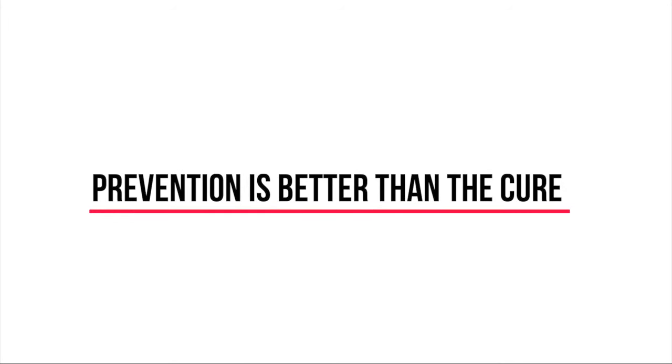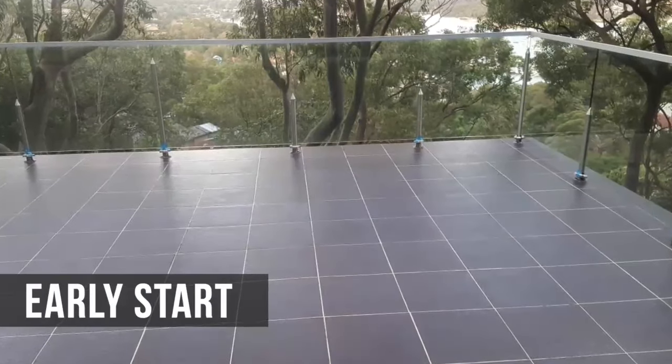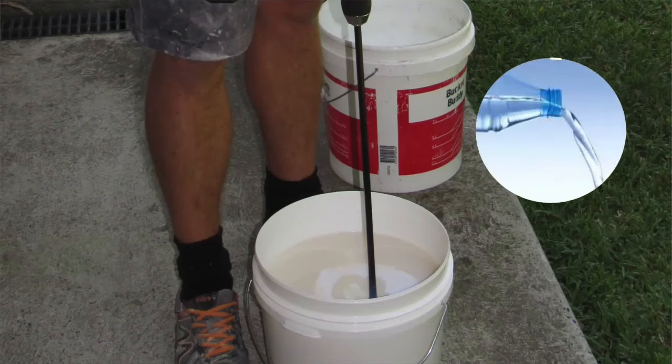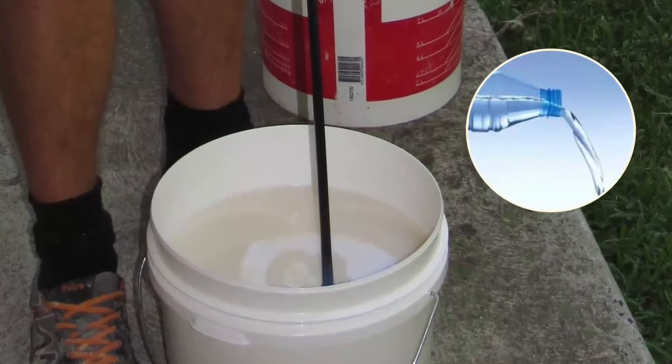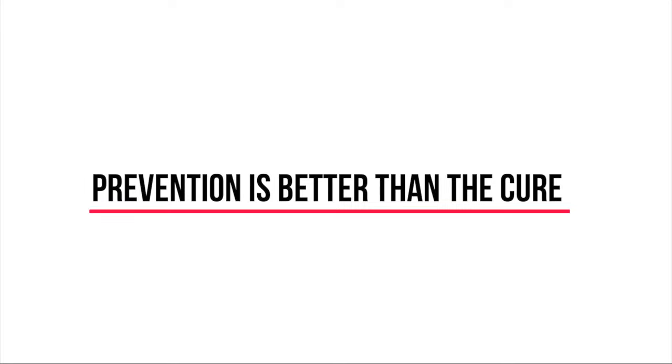The best thing to do is prevent the situation occurring. You can do this by starting early in the day when the sun is not at its hottest, throw a tarp over the area to protect it from the sun, or add up to five percent water to the membrane to slow the curing down, giving you more time to work with the membrane, or all three. Please note: accredited installers who have been installing the membrane for a long period of time can still get caught out, so always keep an eye on it. Once you've installed the membrane a few times, you will actually hear when this is occurring, but in the meantime take steps to avoid it happening.